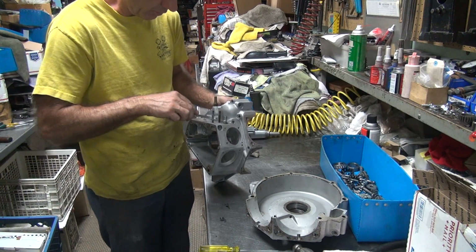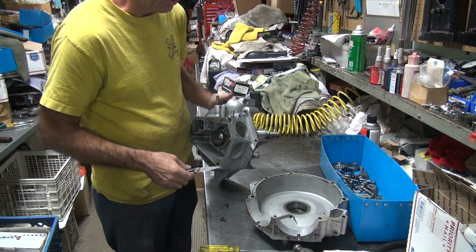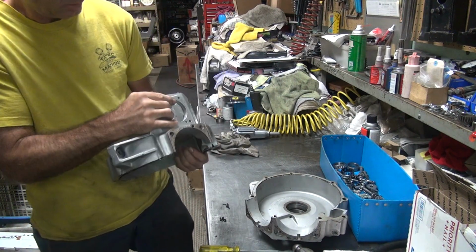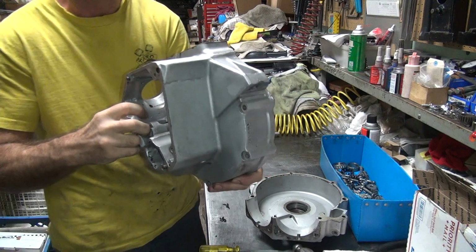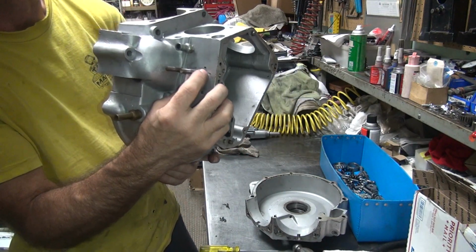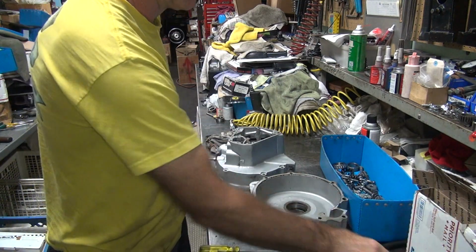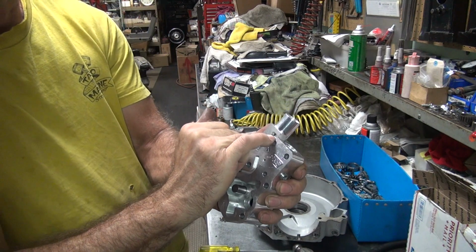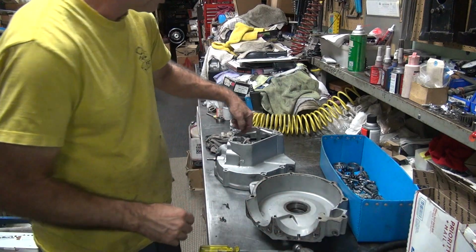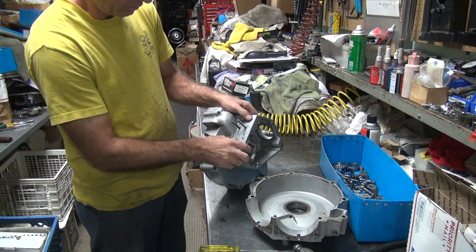Yeah, you got a nice oil pump, don't you? It's got the upgraded hole in here for blowing oil through. Just trying to make sure that was going all the way through. Should be a hole on the inside here if it does. The hole's in the top of the stud. That's the new hole, because on a new pump, you have a bleed off hole right here. The old pumps didn't have that. They had a big hole inside the breather and dumped the oil into the breather. A little different how they do stuff.